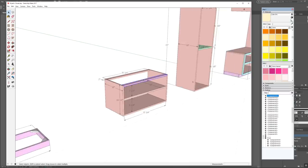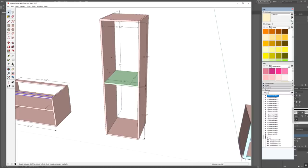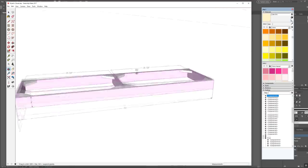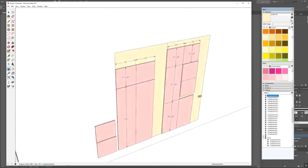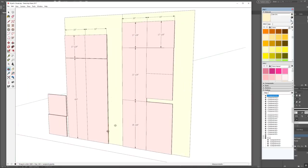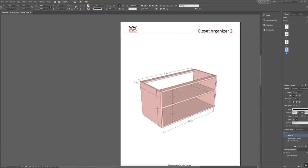This taller cabinet is also going to be really simple — all adjustable shelves except I want a stationary shelf in the middle just to help give it stability and keep the two sides from bowing out. It's all going to sit on a base, kind of a toe kick like I did on the previous one, like basically all cabinets do. Since these plans are just for myself, I'm doing a crude layout of the cut list, but I like to make plans I can follow with measurements easily in my shop — I don't want any guessing when I go to build.